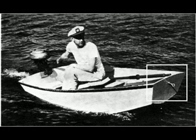In the picture before, the towing eye is mounted much too high on the bow. The eye should be mounted as low down as possible so as not to depress the bow in towing. It also projects too far and will be vulnerable to bending. Also, I followed the dimensions when cutting out the side panels but found they were an inch too short when offered up. Could be an error in the plans or my measuring and cutting, but I would keep an eye on this. I had to shorten up the frame dimensions to fit the planking.